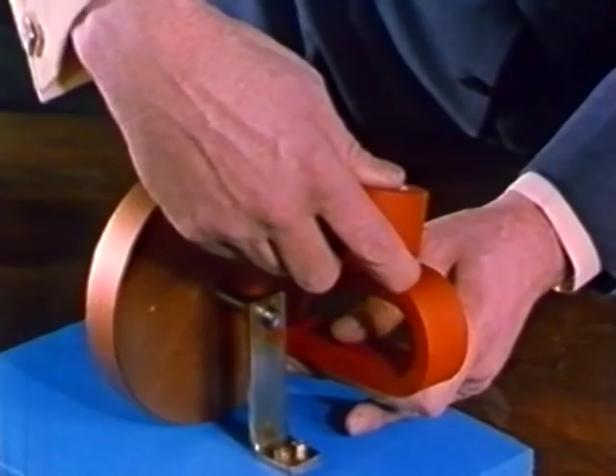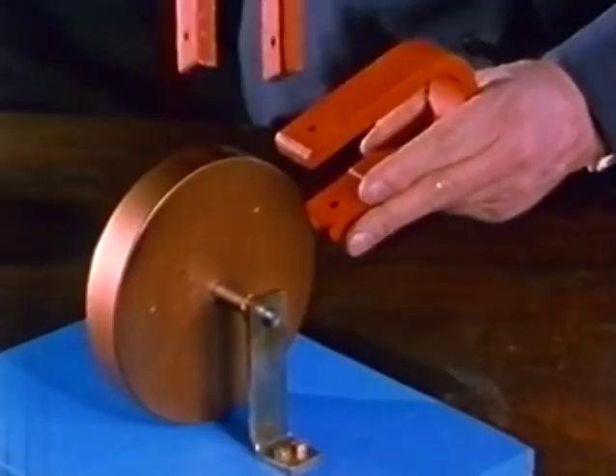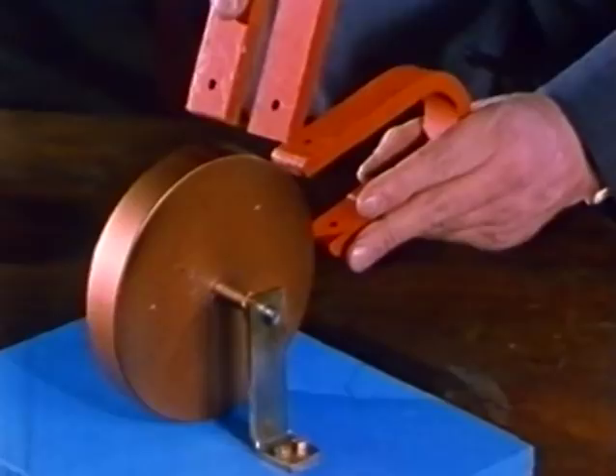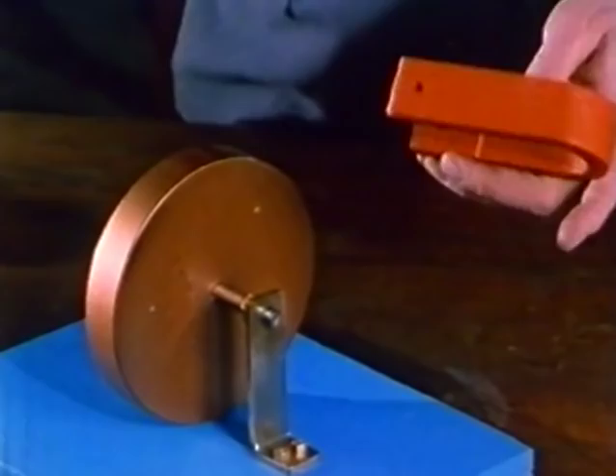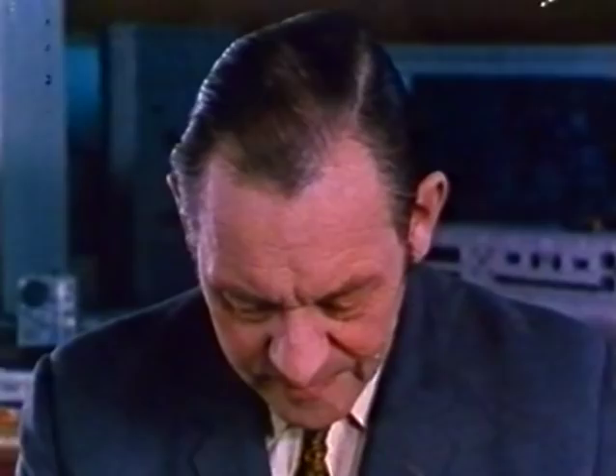Yet another man said, let's put the magnets on the edge of the disc and make the disc into a cylinder, elongating it axially. They realised that this was going to make rather a large diameter motor, so they said, let's fold the magnets over. And now, realising that they were using the side of the poles rather than the front, they could put another disc here and have another set of magnets, making a long machine that way. So engineers between 1830 and 1880 were simply changing the shape of Faraday's disc to try to produce better electric motors and dynamos.